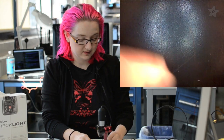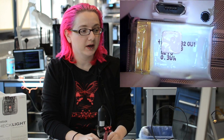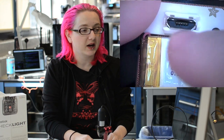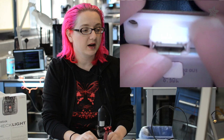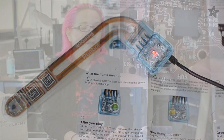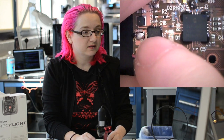Let's look at this circuit under the microscope. Here's that little battery — it says 0.3 watt hour, a little LiPo — and it looks like there's a little protection cell as well. There's a micro-USB jack with a plastic surround that protects it and keeps it solid from flexing the flex PCB, which is very delicate. The battery goes into a little chip marked LCVV. We looked this up and it's a part from Linear Tech — a dual battery charger and buck converter, a two-in-one.